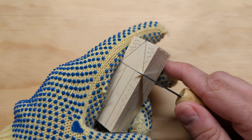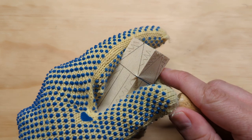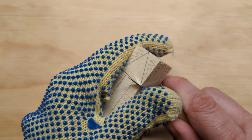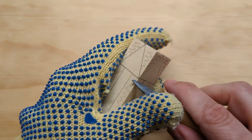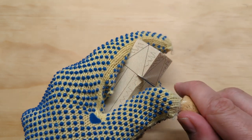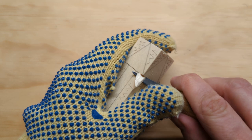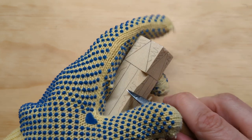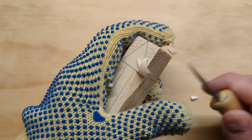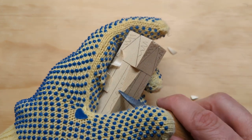We're going to place a stop cut right at one of these corners that we're going to carve off, right where it goes into the base. A stop cut is a cut placed directly into the wood perpendicularly, which stops our push cut that goes into it and makes a chip that comes off. I'm going to repeat that — make my stop cut a little bigger, make another push cut into that, and keep doing that until I get down to the line — the width of the corner I want to carve off.